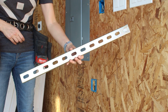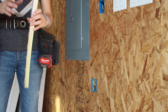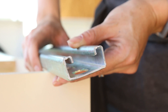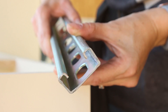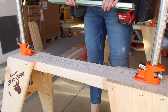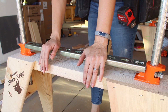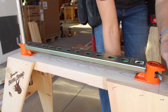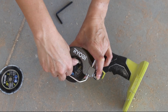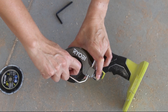I needed to make sure it was at least between 24.5 and 25 inches so it would accommodate a pre-cut 24-inch length of steel Unistrut. Unistrut is a type of profiled steel where the sides come up and wrap around kind of like a C and create little C's on the ends. This unique shape makes it very strong even at long lengths and prevents it from bending easily. When I lowered my Unistrut in place on top of the pipe clamp tabs, I realized it was just a smidge too long — I ended up needing to cut off about an eighth of an inch.